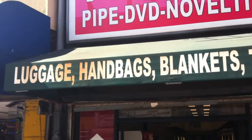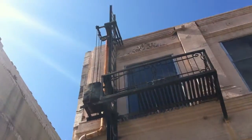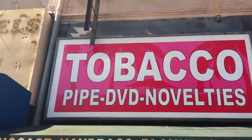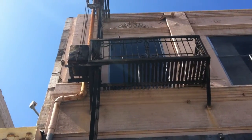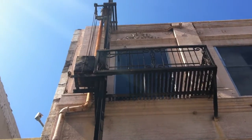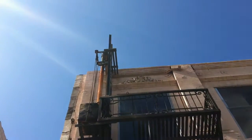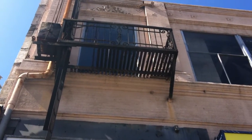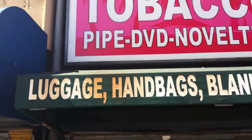Let's take a look at the weight box. By the way, there's a canopy here with no tear-out, so should that ladder come down, it's not going to be able to come through — and we're right here at 345 Broadway. The release mechanism appears to be in an open position, and that ladder is not coming down. There's a chain that's not functioning, so somebody could fall onto the platform but not descend. There's no blowout — there are structural bars actually keeping that ladder from coming down. So we have a violation here.